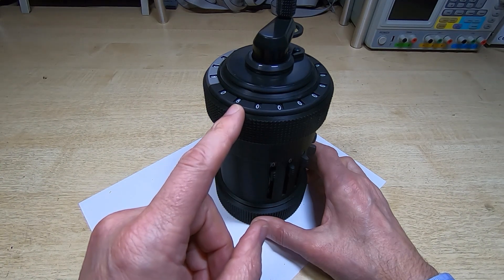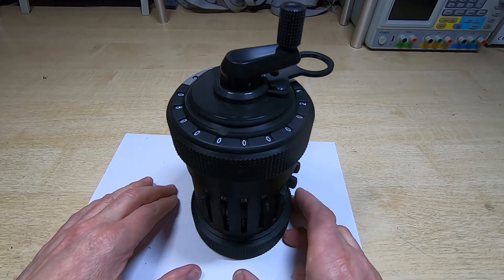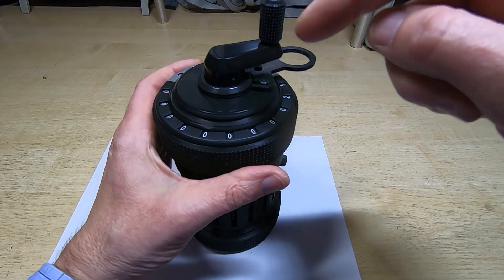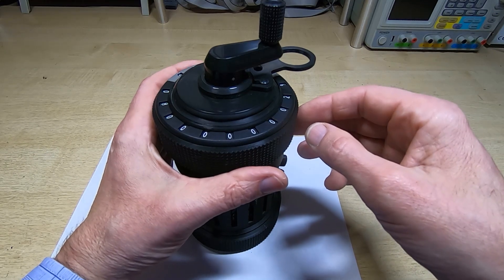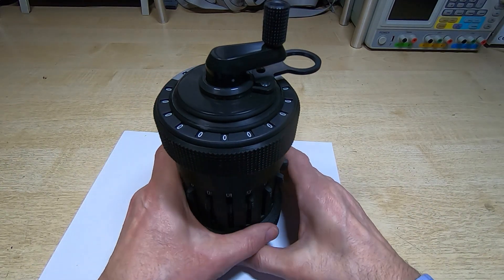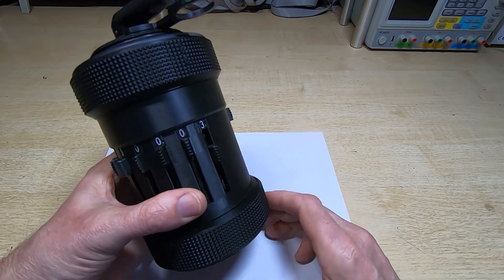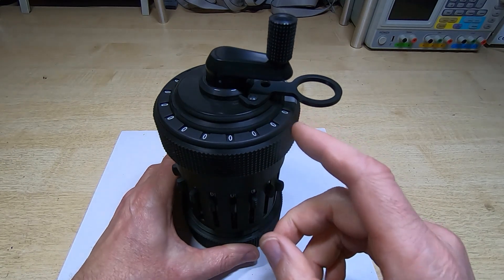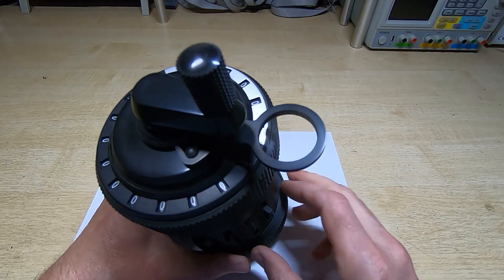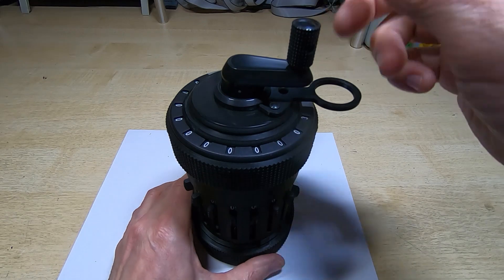These three end digits won't behave properly until I've glued them because they'll catch on some of the other gears on the step drum, so you can ignore those three for now. We'll give it a quick try: first, clear the dial and the counter. Raise this, rotate this — it rotates very freely. I've got three sets on the input, all set to zero apart from the first one, which is set to three. Each time we rotate the crank we should see it increment by three, and the count should go up by one. And there we go — three on the results and one on the counter.